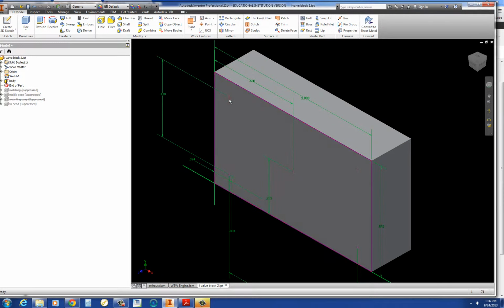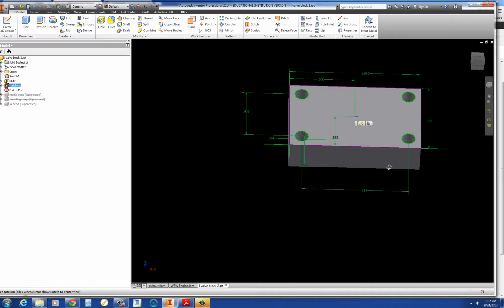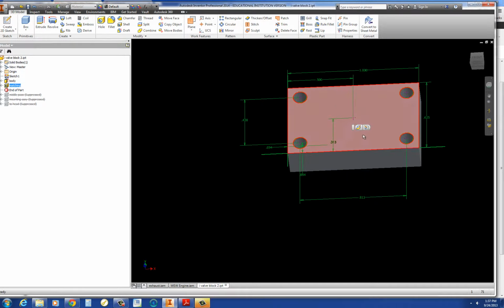So what we have now is the body, and I have all these points in the first sketch from the body. So they're dimensioned and they're aligned. If I go to this sketch, you can see that it's been moved outside the body because it's used in more than one feature. So the next feature that I created was these through holes. These are the matching holes. They're the through holes that go all the way through the valve on the left. They're just simple through holes for the screws. On the intake we'll have countersink holes for the heads, and on the exhaust we'll have threaded holes. But still, I have these holes. So I've got that done.